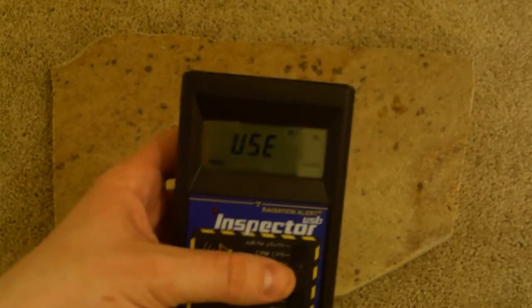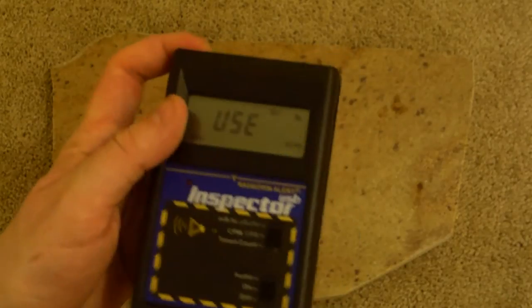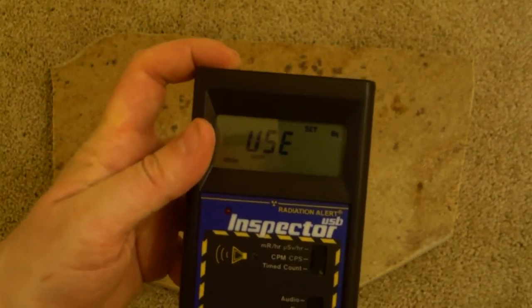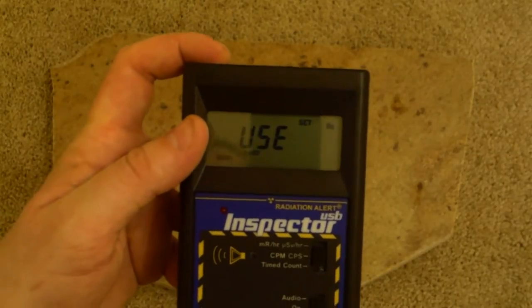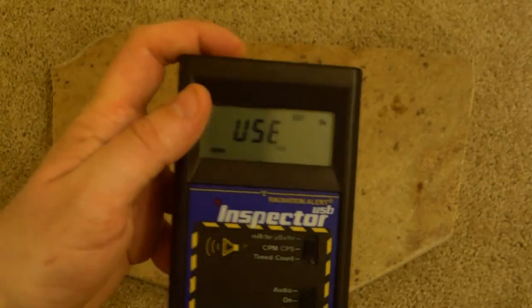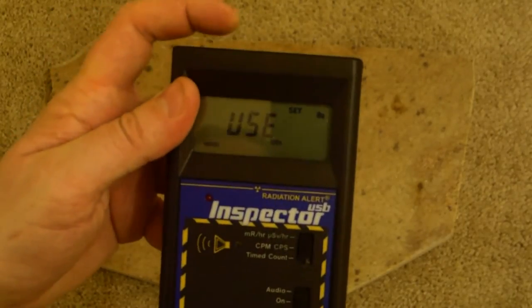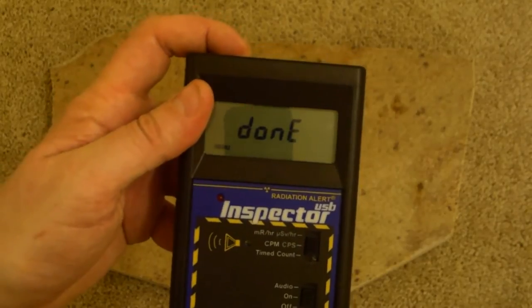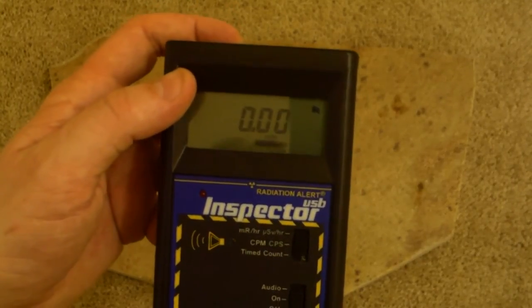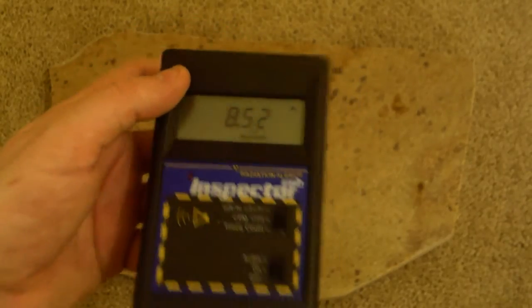Now, these are actually user-configurable efficiencies, and I'll show you how to actually do that in just a minute. So let's switch to one of them that we want to use. We're going to pretend that we have bumped into a nuclear scenario, and there is potentially iodine-131 in the air. So we switch to iodine-131, click the set button that says done, click it again, that starts everything up. Here we are looking at becquerels. How many becquerels, which are decays per second, of iodine-131 are there?